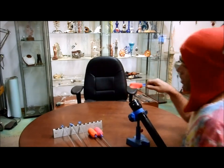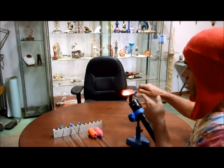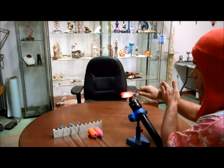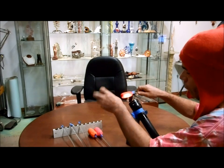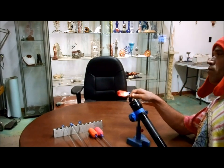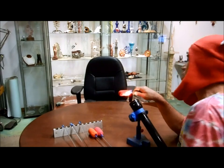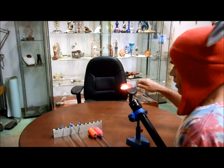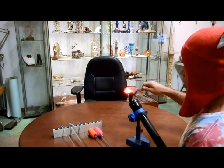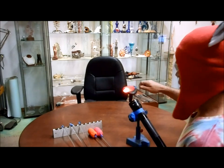And so basically, that's a really important thing to know, is as you're heating with one handle, it's gonna torque and turn on the cold point that's closest to the handle. The one on the end is kind of free-floating. It doesn't have much tension other than just gravitational force of what's holding it, and the rotation's holding it centered. So basically, a few more things to keep in mind as you're practicing doing seals, as you're practicing doing gathers, as you're practicing prepping up your ends.